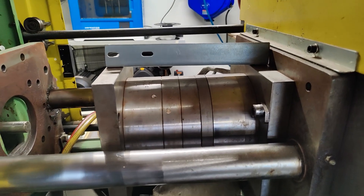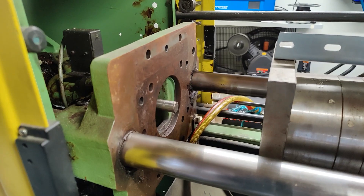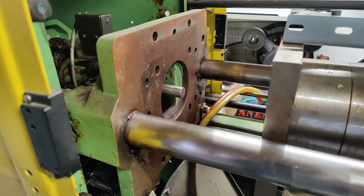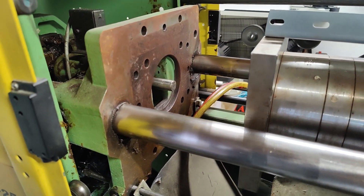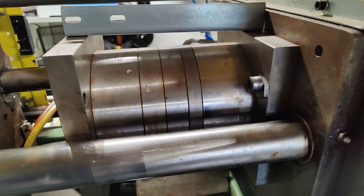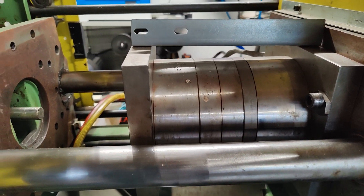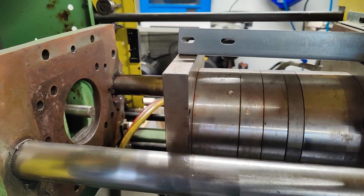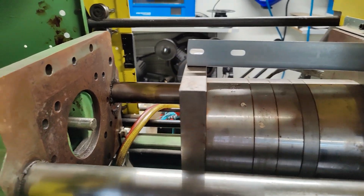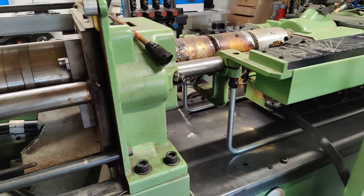I managed to get them all in at one end, but as I remember, I actually need to fire up the machine to get the back there to move in before I can mount the other side of it. So right now it just sits there and I've tightened the screws but not completely, because as I read it, you need to apply pressure first and then secure the mold completely with the screws. So no way around it — I need to put power to this machine.